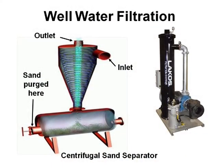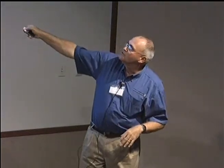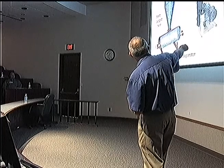You want to oversize your screen — it's a good idea with any screen or filter. If you have problems with sand in your well, this is called a sand separator. Lakos makes a bunch of these. The water comes in through the inlet into a cylinder, and because of the way it enters, it spirals like a tornado. Since the sand is heavy, it settles out, and the clean water goes out the top. You need to match the flow with the size of the cylinder, so talk to a professional. You can remove the accumulated sand from the bottom.